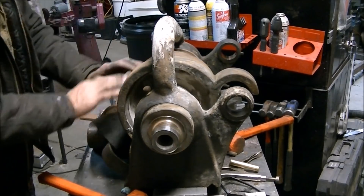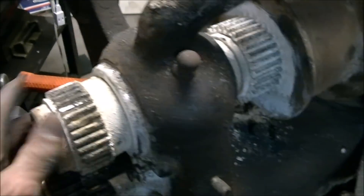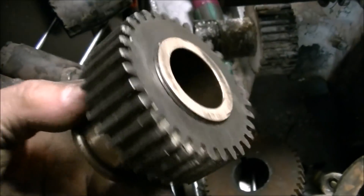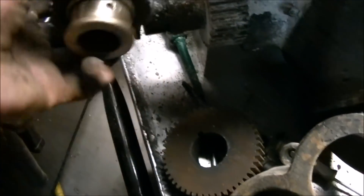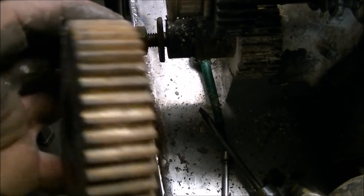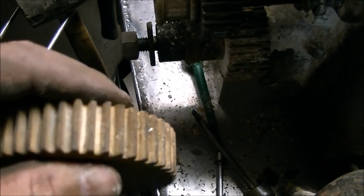The spindle has a little bit of a stiffness but it's mostly from the gears. When I disengaged that sliding gear that disengages the lead screw — you can pull out on that little brass handle to disengage the lead screw when you're not feeding or threading — once that was disengaged the spindle wasn't too bad. You can see the gear teeth on this thing don't show a lot of wear. They're rusty and dirty but at least they're not worn out.